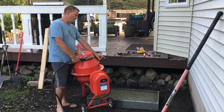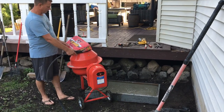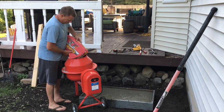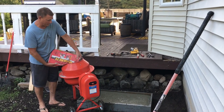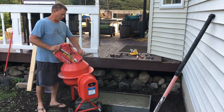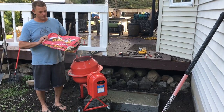I had to run back to Home Depot to get more concrete, but I got a different kind — the 50 pound bag fast setting. That'll mix with this. So we added some water. That other style has more rock in it, and the rock tends to come to the top after a while. If you want it to be nice and smooth, you may want to go with something like this.